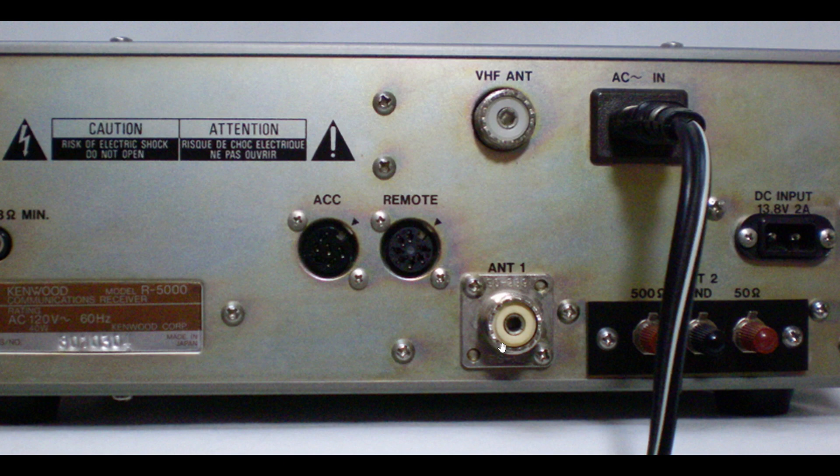You try to match impedance as much as possible. The antenna itself could resonate and match 50 ohms with a coax cable that brings the signal to your radio, and usually that will match correctly without needing anything extra. For example, my Yaesu has an EFED antenna, which is more of what we call a high-Z antenna. It actually has a balun — a 49-to-1 balun — which acts as a little transformer that changes that very high impedance and matches it closer to 50 ohms so I can use it with a transceiver.